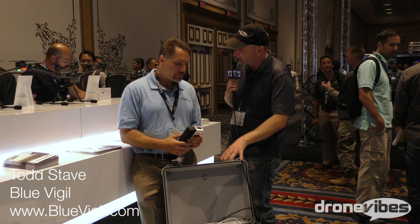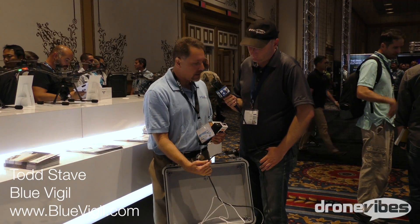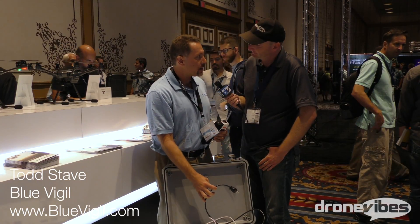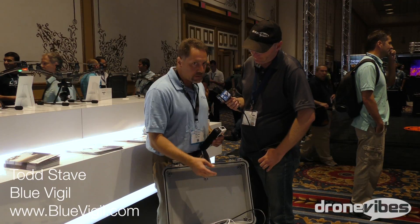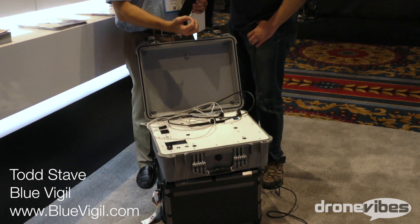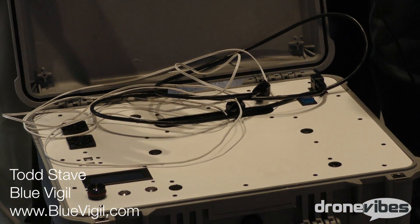How is the unit itself powered? It plugs into a normal 110 AC outlet. We're selling these in Europe with 220. Interestingly, when you put 220 in here, you can get a little bit more power out the other end, so you could power even bigger drones or have more altitude. The spool here is a reactive spool, meaning it doesn't push or pull anything — if the aircraft goes up, it feeds out the cable, and as it comes down, it brings the cable back in. There's a fleeting sheave and a spool so that the slack is taken up or let out as necessary.